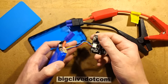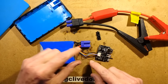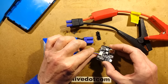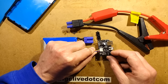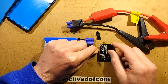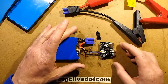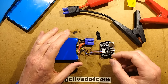The circuit board has four connections: one at either end of the cell - the red and black - and then the blue and yellow are the intermediate connections off the series of cells in the battery, which means the circuitry can balance. I was kind of expecting a balancing circuit, and there is one - it's based on the DW01 cell protection chip. There's one on this side and two on that side, with lots of transistors. One thought was maybe it's doing a clever trick where, with a 5V supply in, it's switching through the cells.